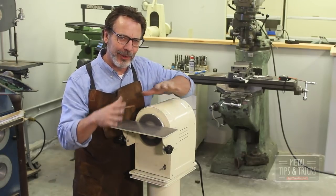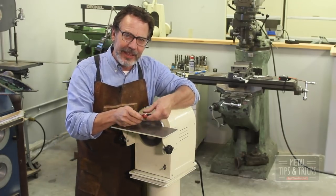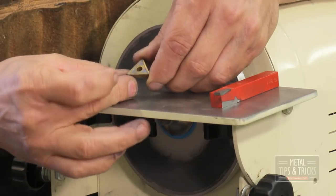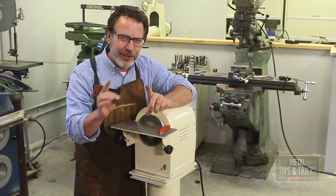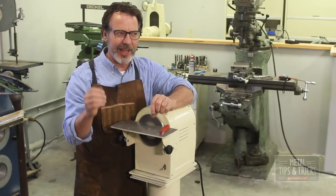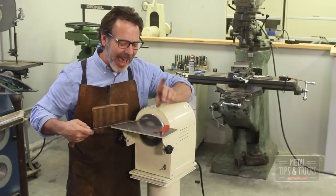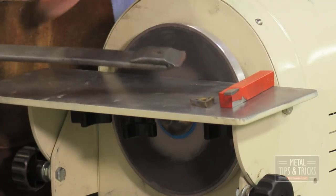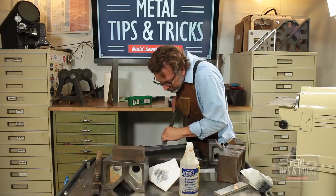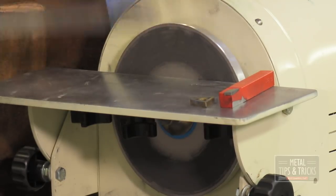The next video I'm going to do is show you guys how to use the slow speed grinder. One of the things I really like it for is braze-on carbide — works great for that. Also nice little surprises working with carbide inserts. Now you do understand that as soon as you sharpen a carbide insert you are changing the geometry of it, but since it's dull it really doesn't matter — you might get a little bit more life out of it. The reason I actually built a slow speed grinder is for this tool here — it's a scraper. I've got a video coming out very soon on how to scrape, but to sharpen these, the real key is a slow speed grinder, and that's why I made this.